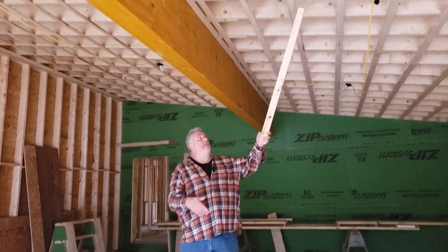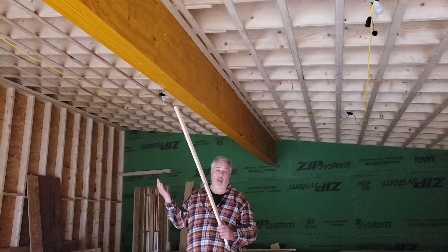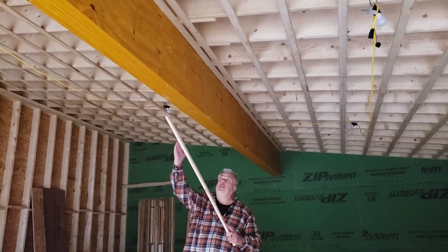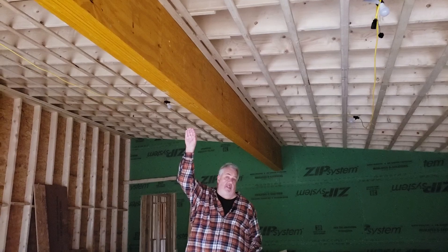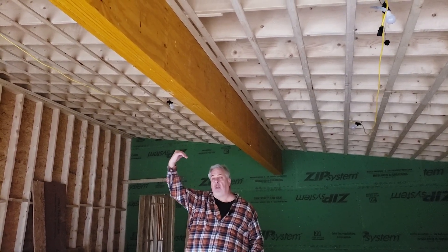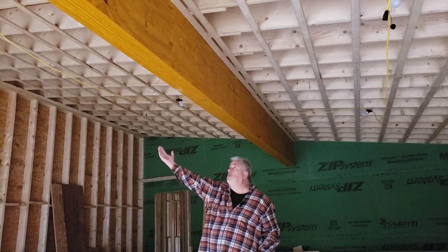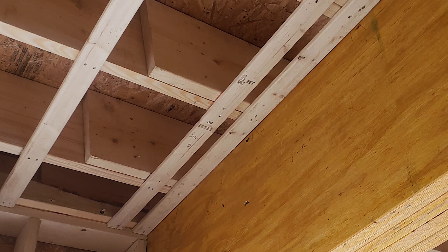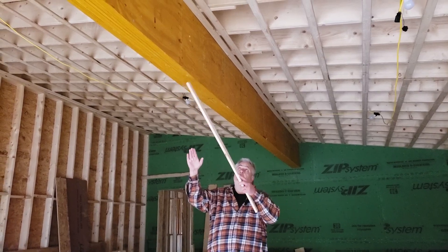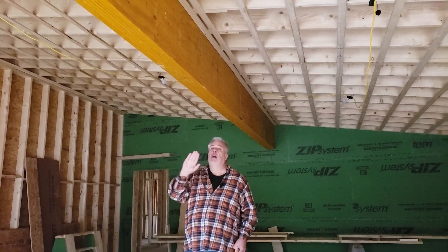So how do we do that? We have our common rafters. You can see our two-by-12 rafters here. And that two-by-12 comes up basically like it would treat a wall. So that rafter comes up and I have it specced so that it extends 12 inches on the other side of the beam here and basically has the seat, the bird's mouth cut there. So it would sit just like it would sit on the upper portion of the wall there. This is just an intermediate support. On the rafters to my right, those are the two-by-12 rafters. They come down and you can see we have some overlapping here. And again, that overlapping is called out to be 12 inches on each side. So basically what we're getting is we're getting this seven inches plus the two feet, so we're right around 30 inches of overlap.